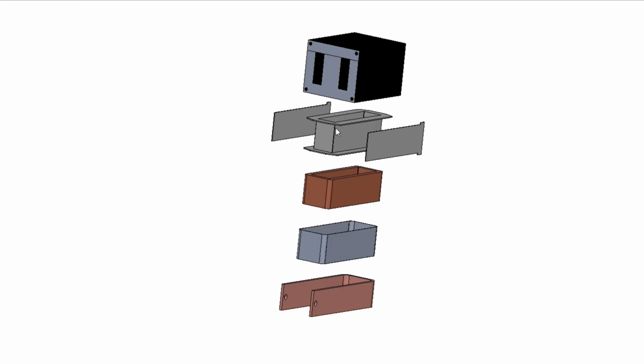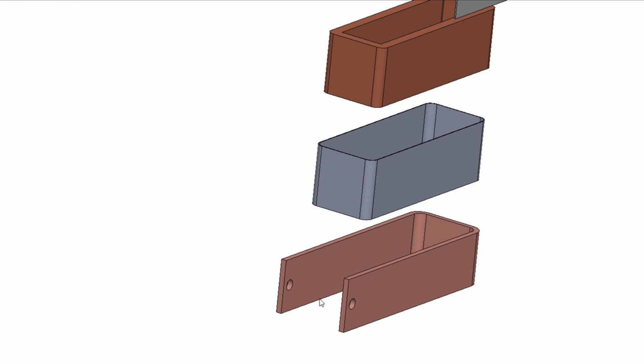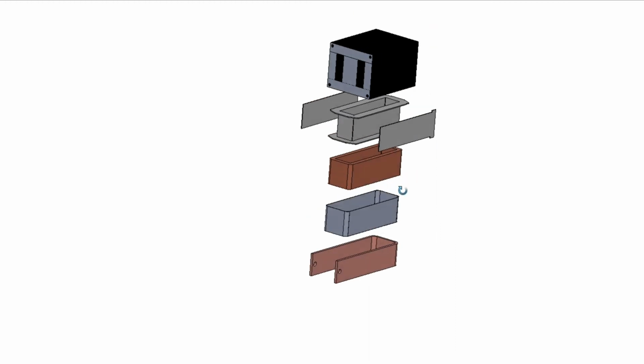Now you don't slide it on, because the stack is actually bolted around the core. It's not like a microwave transformer where you just slide it on. The core is crisscrossed the whole way on and bolted on in a stack with this bobbin. And this secondary winding then is slid in. I think the secondary winding is made up of 20 pieces of copper strip at 40mm wide. It's the width of this E&I, roughly 40mm as far as I mind. It is 4mm wide, that's as much as I could fit in, and the bigger the better, as it's high current. So I think there's 20 strips in there at 0.2mm thick, and so it gives a good thick cable. We'll look at the calculations in a wee minute, and we will compare it with round cable.